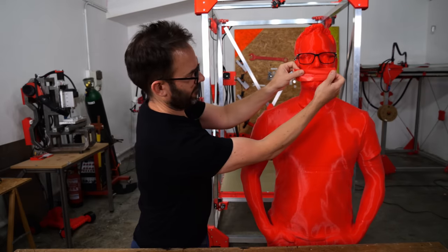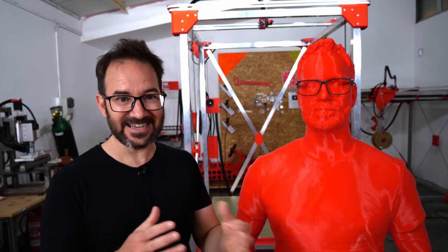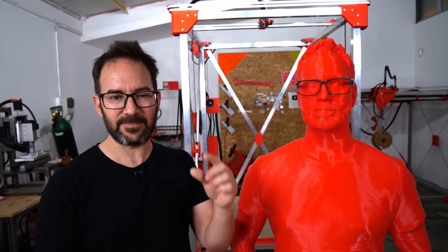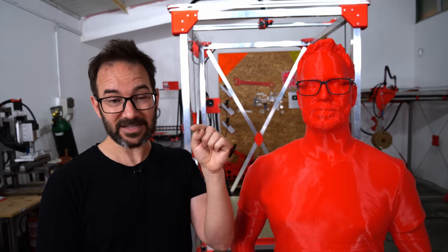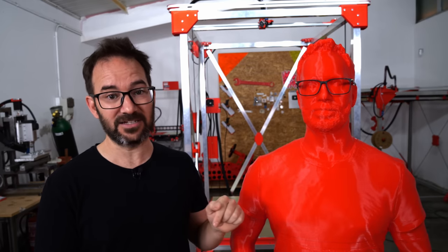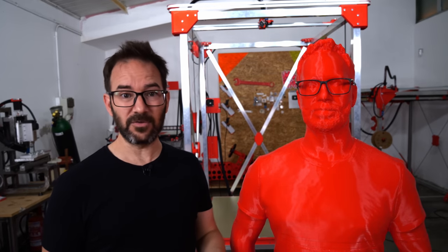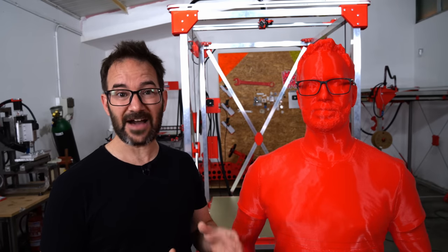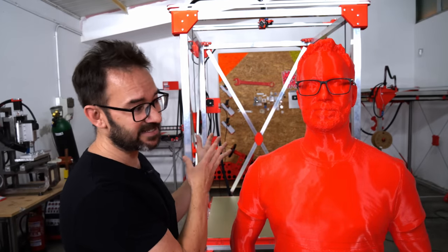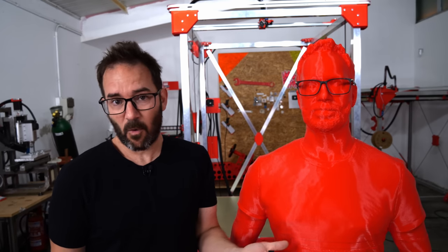Hey, what? In the end, we think that's quite a nice machine. There are a few things here and there that need fixing. For example, the touch sensor was a bit too low and was hitting the part. That's what caused the layer shift on the ankles. We think it's a great addition to the shop. If you want to give it a go, there is a link in the description. Remember that the design is modular, so you don't have to build it in this exact size. And now that you can build the bed in any shape you want, you can go wild.